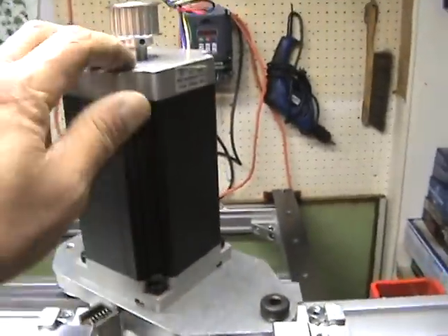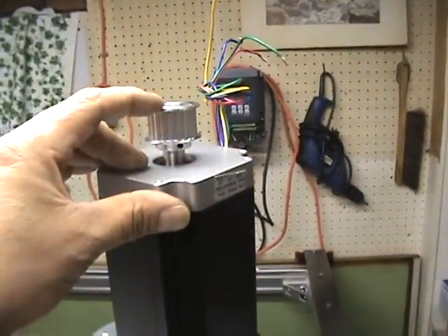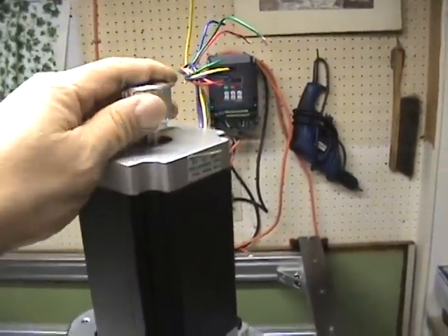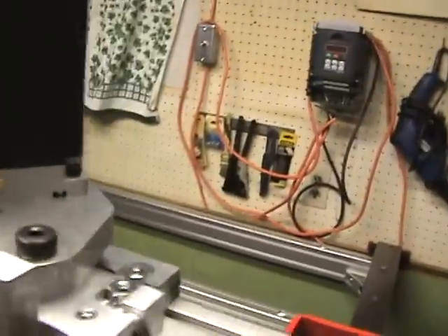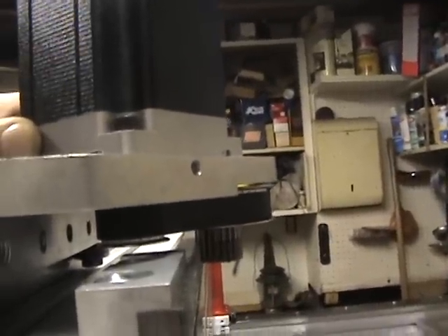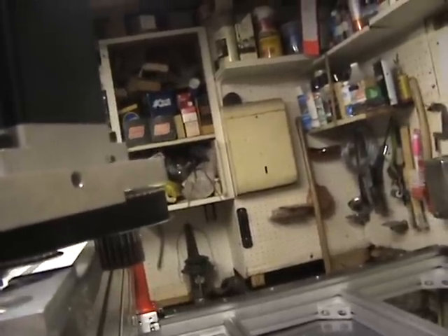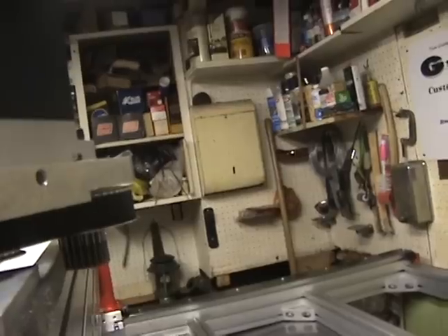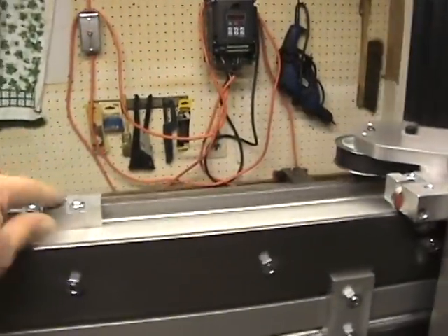For my case, my motors are a 14mm shaft, so I had to have these bored out to 14mm. I just put this on here so that I can kind of turn things. The setup also is that the shafts are about 2mm longer — it's just enough to clear the rack mounts. The belts do line up okay: one's on the high side of one pulley, one's on the low side of the other pulley. But they do line up and they just clear by about 30 thousandths of the rack clamps.